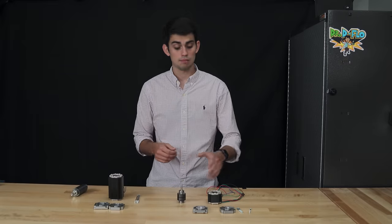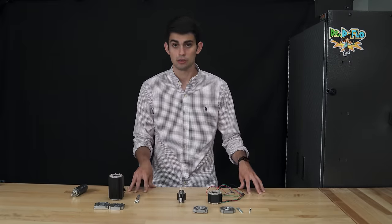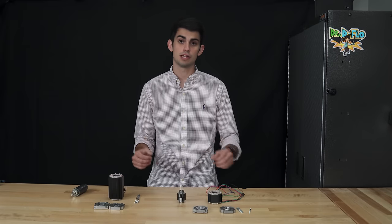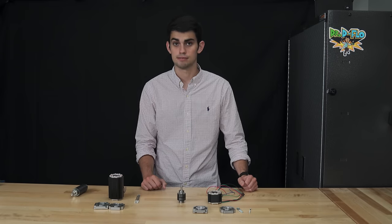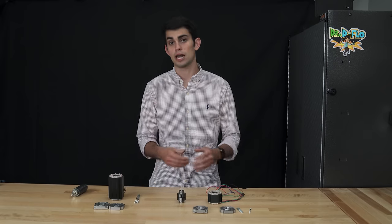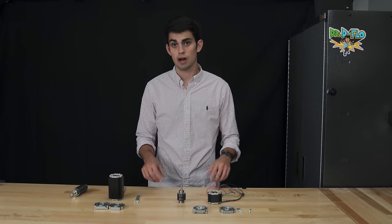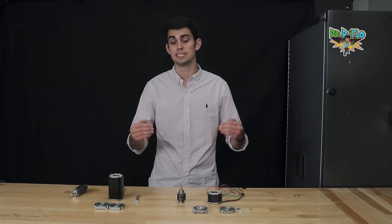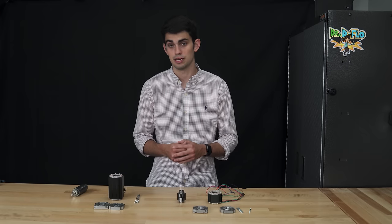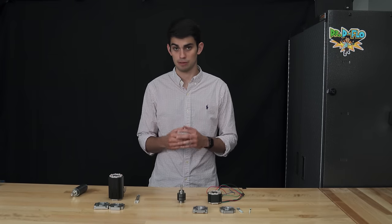However, the amount of torque supplied by a NEMA 23 stepper motor is almost always overkill in a normal size 3D printer, but are commonly used in other CNC machines. One of the drawbacks of stepper motors is their power inefficiency. When on, stepper motors consume current independent of the load. Therefore, a resting stepper motor will consume its max current when given the opportunity. That's why it's important to not buy a stepper motor that is too powerful for your application.